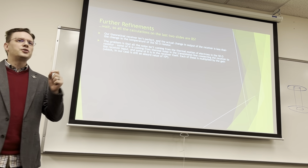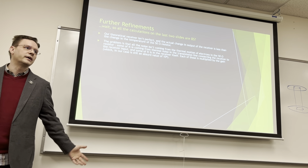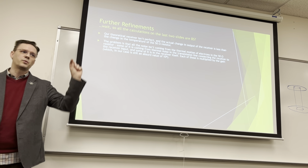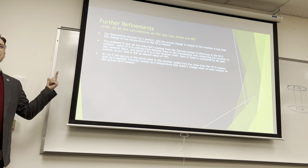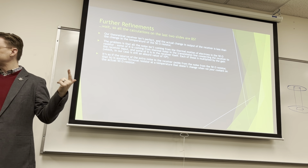So it's not that you can just cool one part. You can't just cool one resistor and instantly have perfect noise. You got to cool everything, right? That's why the entire observatory is on the mountaintop in Chile and not just one special part. And for those of you wondering, you can't put it in outer space because satellites get hot. Anybody in PSAS will tell you that. There's nowhere for the heat to go. There's no air. Things get hot. Actually, things get very hot in outer space, as far as our electronics do.